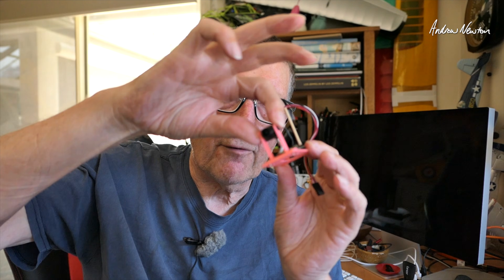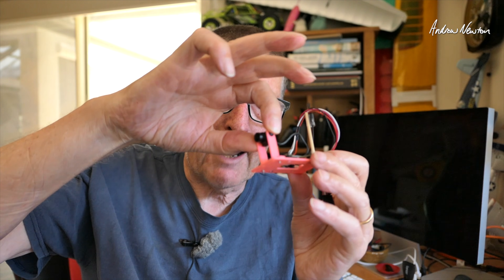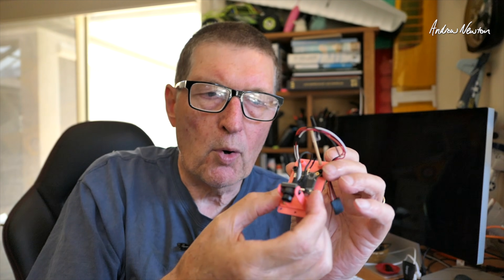It's a tiny little 14mm wide camera on a small board, with no onboard recording, and they do heat up very quickly. The supply voltage is from 3 volts to over 12 volts. So you can run it off 1S for tiny little drones, but you have to be careful — you can't run it off VBAT if you're running 4S. That's something to be aware of.